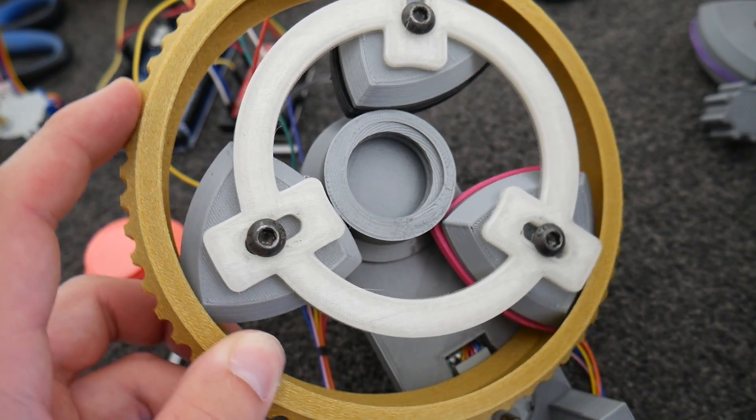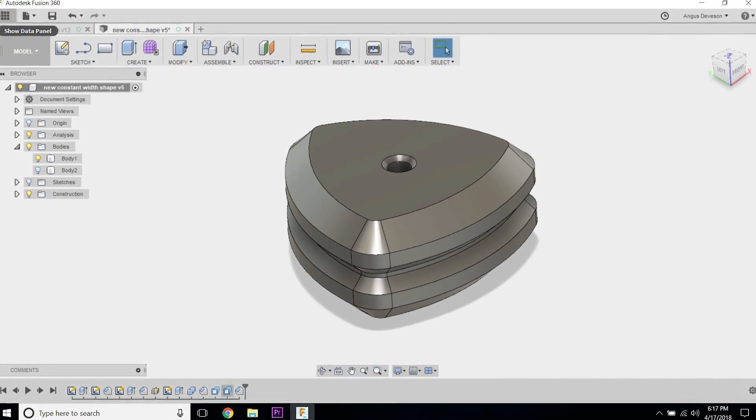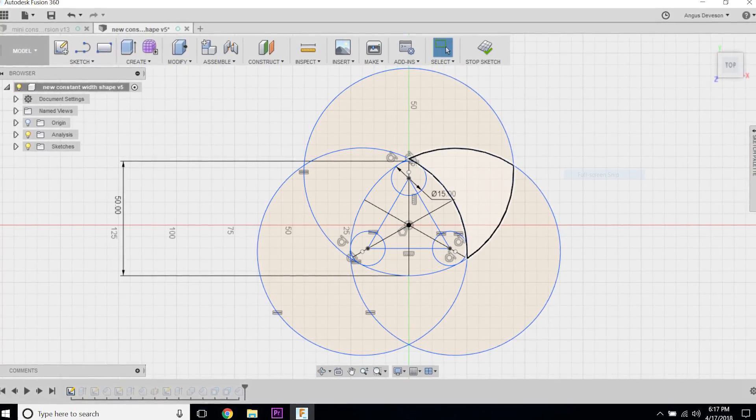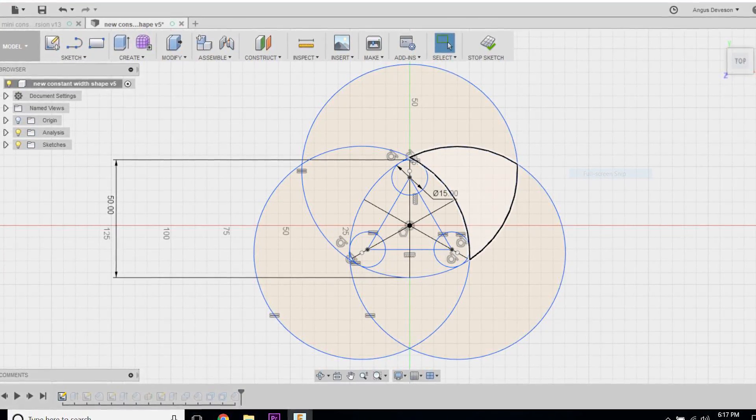But by this point, I was growing frustrated with just how hard it was to rotate the shapes past each curve. So I caved and went about modifying the shapes themselves — the Reuleaux triangle — to be ever so slightly rounded on the corners. Though it turns out creating a rounded Reuleaux triangle isn't a super trivial exercise. You need to pay close attention to the tangential relations of each part to ensure it's truly a shape of constant width and not an almost-but-not-quite shape that doesn't have a true constant width around the whole object.